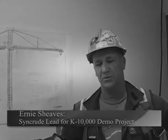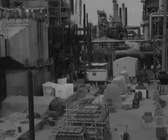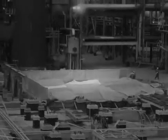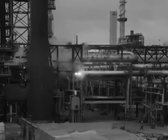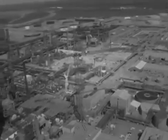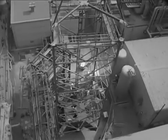We were given the task of building some planning for the Syncrude Emission Reduction Project. At the time, the original plans called for crawler cranes to do just about all the work. It became a very enlightening job to look at the original plans, and the actual job of getting it done with crawlers became very difficult. We located a K10,000 on the internet for sale in Copenhagen, Denmark from a company called Tower Cranes of America. The findings were that we could do 98% of all of our heavy lifts with this one single crane sitting in a 40-foot square area.